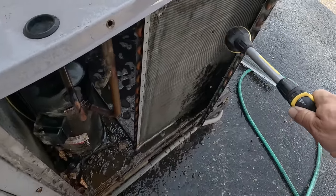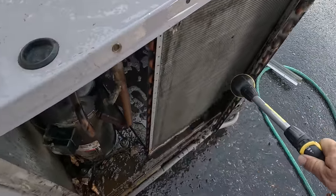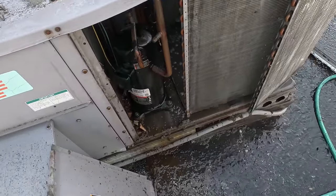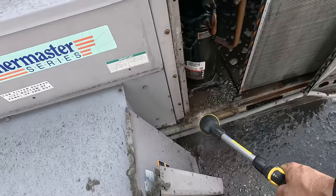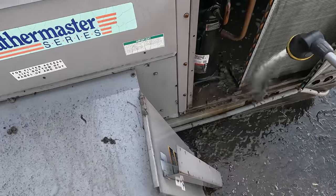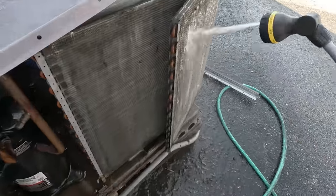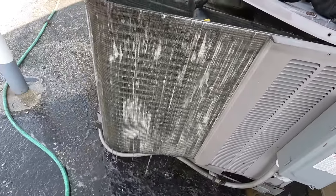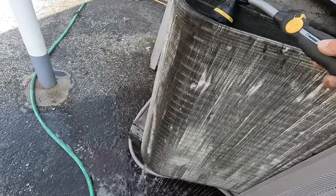You're about best off to go ahead and blast it straight down first to get this debris out of the air — otherwise you're just going to shoot it right back onto the coil again. Once you've got the majority of it, then you can go through it again. I've found it easiest to just knock it all straight down and then start working through it. That jet makes a nice, strong, tight pattern — it gets down in there and just knocks it completely out. I don't care how much coil cleaner you use, it's not coming out. It's matted in between there and will not come out. You can see how much crap is coming out even though we've cleaned it — it's still dirty.